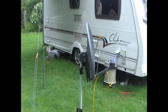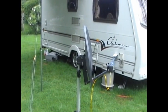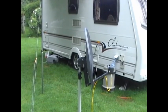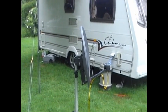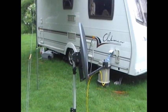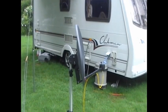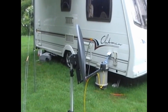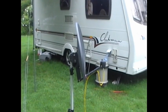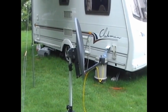Most dishes are of an offset design. By this I mean that the dish needs to point below the angle of the satellite so that the signal strikes it at a downward angle. So if the satellite is say 24 degrees above the horizon, as it is for example in the Midlands, the dish might actually need to point directly at the horizon. As you travel further south you'll need to tilt it back a little, and here in mid France it will need to tilt upwards by about 10 degrees. So basically start with the dish face vertical and only raise it if needed.